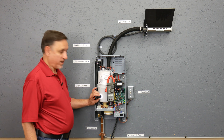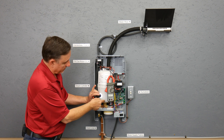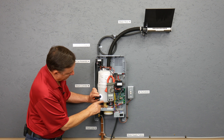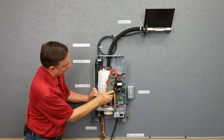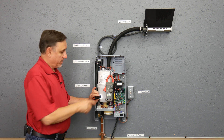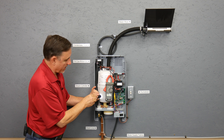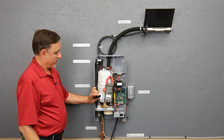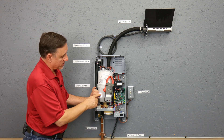I'm shining a flashlight on the side of this tank because it makes it a lot easier to see the water level when working on these units, especially with a nice new tank where the water is pretty clean. Now we can see the water level is about here — we're still drawing nothing. As the water level rises, the amperage will go up to the point where the algorithm inside this motherboard says it has enough water. There are no float level sensors in these units — it does everything based on amperage.